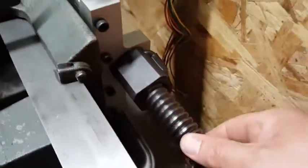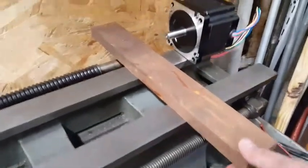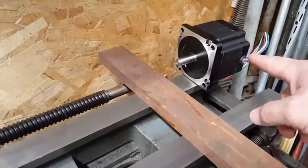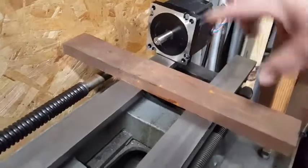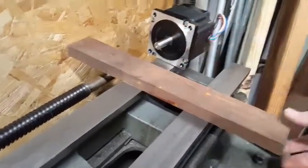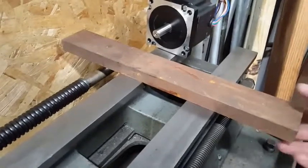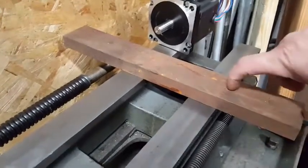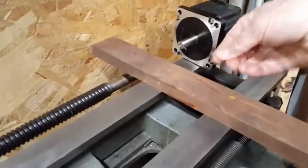We have this bracket down here with our one-inch screw for the z-axis. The next step is going to be this bracket for the NEMA 34 motor that's going to run the z-axis. Keeping it really simple — this bar is going to be sandwiched onto the ways just like the tailstock and the steady rest are. I'm going to cut a section of this off, put it up underneath, and run a bolt through it to sandwich it down.